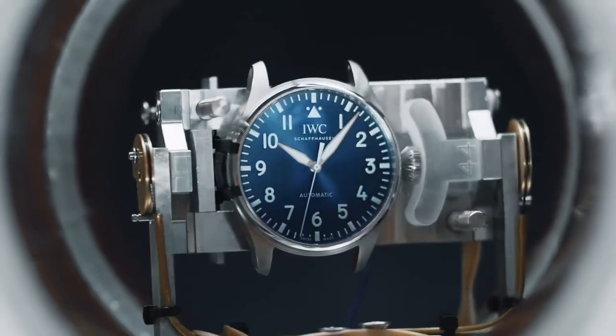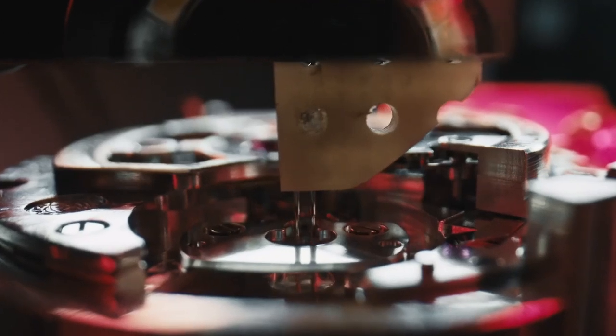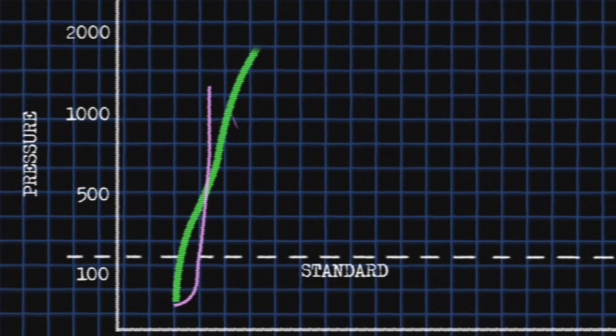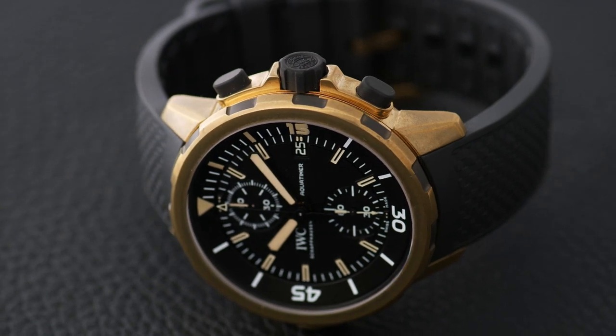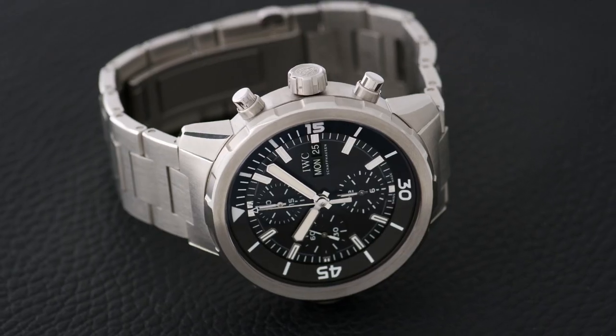Let's get into the details of what these tests look like. While a watch is in the process of manufacture, how many tests does it go through? We test at different temperatures and different water pressures. For example, we do tests with just 10 centimeters or 30 centimeters of water above the watch. And then we test the pushers, the crown, and also the turning bezel under that 10 centimeters of water. But we also go under high pressure — we put about 10 bar pressure on the aquatimer, and also use the pushers, the crown, and the turning bezel with this pressure of 10 bar.